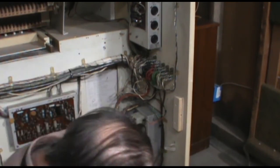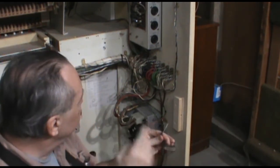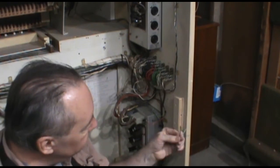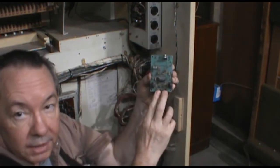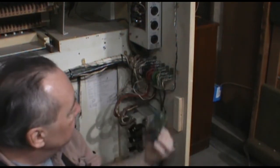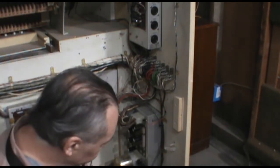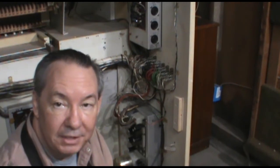This is achieved very simply. If you study power supply circuits, you have a transformer with a center tap, and that center becomes your ground or neutral position. The other thing is, of course, our audio signal, and we saw the other end of this cable. As I said, I've already run it around, and I've pre-stripped and soldered on this, so the rest of this should go pretty clear. The audio signals come in here, our power comes in here, so let's get this thing mounted, and then we'll hook it up and try to test things as we go. This could be a complete disaster, because there might be some little detail I have not foreseen.